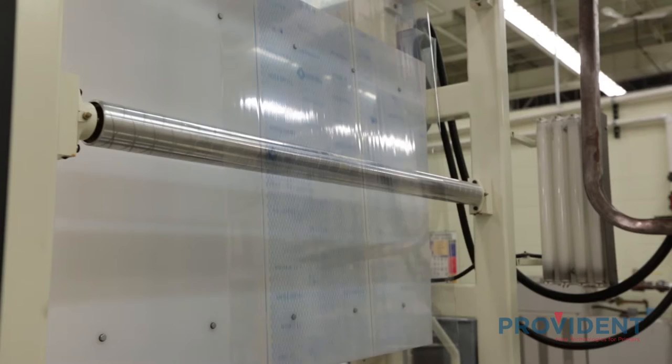This style of system prevents dust, dirt, and other particles from getting into your ink, and also avoids solvent flash-off to help keep inks a lot more consistent. Let's take a look at some of the materials we commonly use to make doctor blades today. In part one we're going to review the different types of doctor blades. The three main characteristics are the type of material, the edge profile, and the thickness.